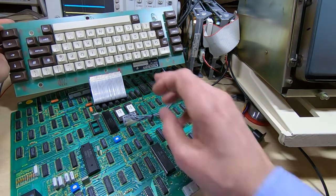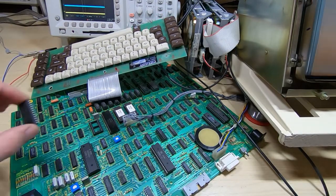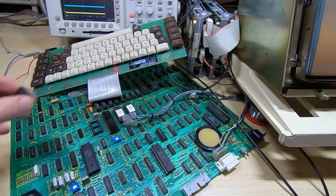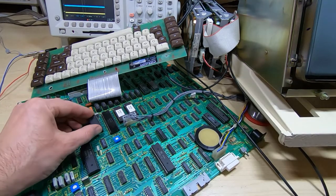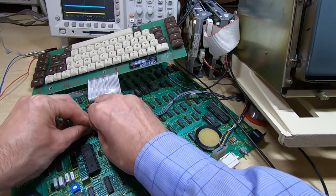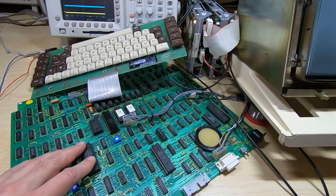So you see it's still flashing 6 times. The failure for testing this device is 9 flashes. In other words, what it does, it gets as far as testing a particular part of the system, and if that fails, it just keeps looping around indefinitely trying to retest that part of the system. So we can't test the rest of it until we get the test to pass that's currently failing.